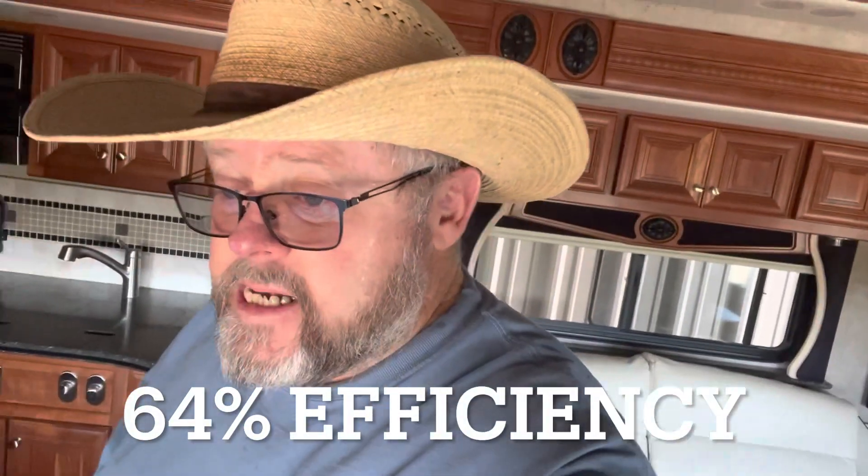That input wattage came up to about 750 watts. I'm a little disappointed — three 400-watt panels should theoretically be 1,200 watts at 100% efficiency. I'm not sure what percentage 750 is, I'll figure that out. But right now I've increased my run time to nine hours — it'll run three air conditioners just the fan on high for nine hours, plus the refrigerator, plus a few 12-volt LED lights. I'm going to slowly cut air conditioners off and see what that does, and I may go unplug solar panels. As I was out there it seemed like the wattage increased up to 750.